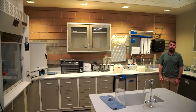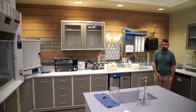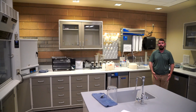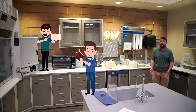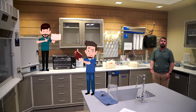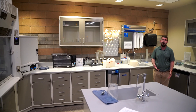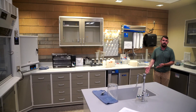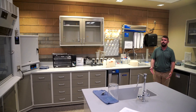So how do we know that the water is ready to be reused again? Well, obviously we have to test it, Drew. After we cleaned all the pollutants out of it with the bugs and then let the bugs drop out and press it into cake that nobody wanted to eat, we need to make sure that the water is actually clean enough to use. So we bring it into the lab here and we test it to make sure all those harmful pollutants have been removed and it can be used in other places like golf courses, people's front lawns and irrigation systems, industrial uses, and recharge facilities.